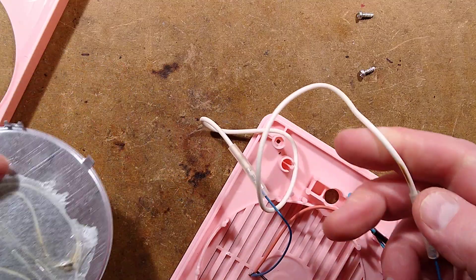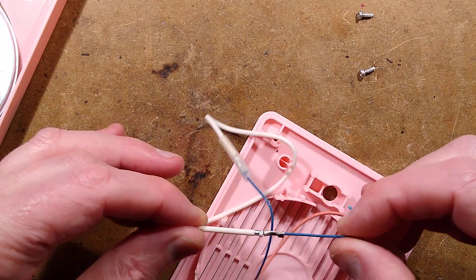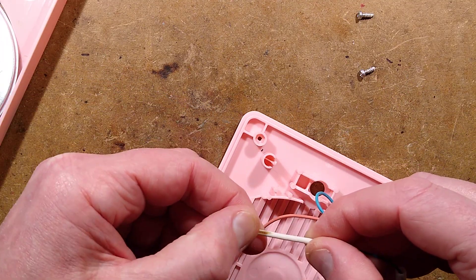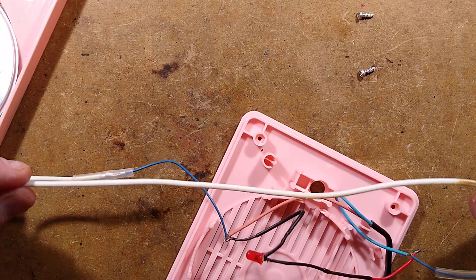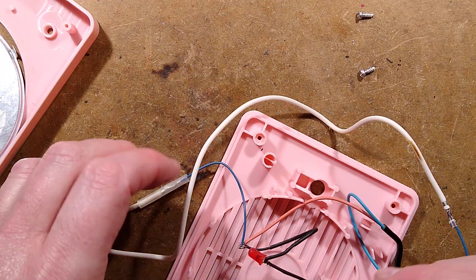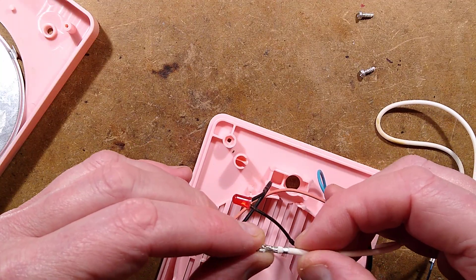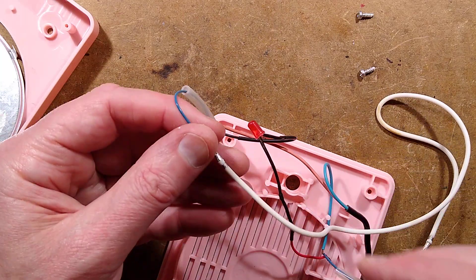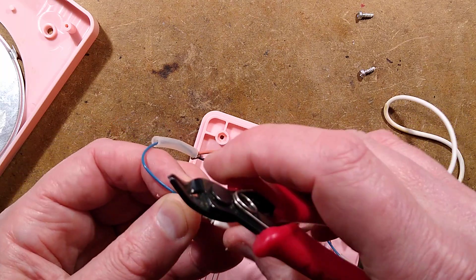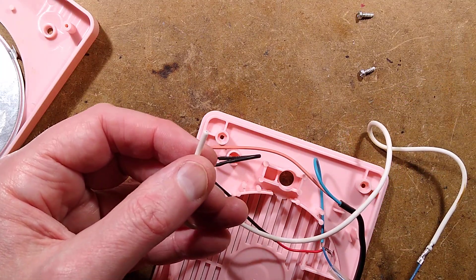Let's take the LED and resistive tape apart. I shall slide this sleeve off and see how it's terminated, because I would expect this to be a sort of wound — ooh, is it supposed to be brown and sproody there? Or is that where the adhesive has been burning? It's possibly where the adhesive has been burning — it's not really rated for that sort of temperature. So I would guess, is this going to be carbon fibre tape? I shall try and open this up. Let's just cut it. Oh, I see a very, very fine — that's the fibreglass type stuff.